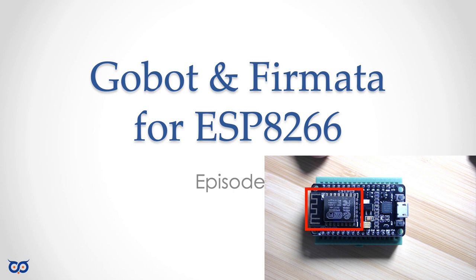The nice thing about this board besides having Wi-Fi is that it's Arduino compatible. So if you follow my first tutorial about installing Arduino, you are all set. The third thing I like is that even though you don't have a lot of pins, the IO pins that you do have — three of them are pulse width modulation. We may not get to look at pulse width modulation in this video but we will very soon, and we'll see how we can use it for dimming LEDs and for controlling motors especially.